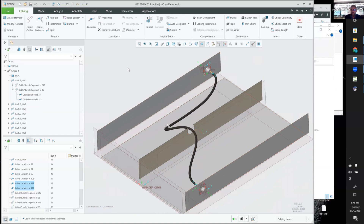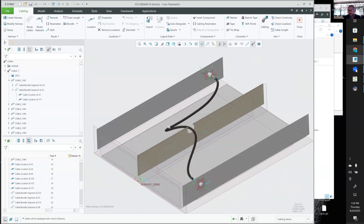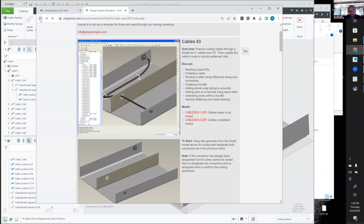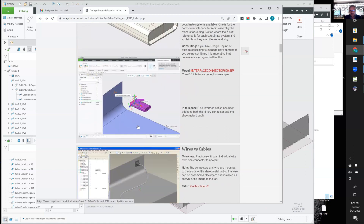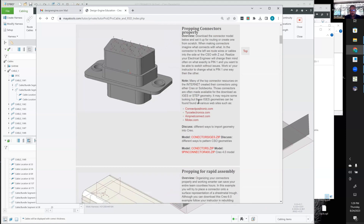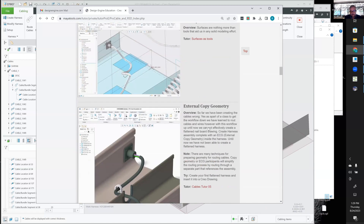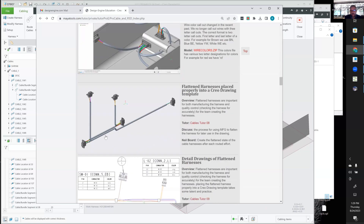Now I'm going to create a bundle that's going to connect all those heat shrink locations. This is the thickness of the heat shrink — let's make it a little thicker. You can assign color to the heat shrink so it automatically generates color — I've got BLK, but maybe GRY. I say 'along path,' go from one to the other, select them all, middle click, then go to thick wire — now you've got your wires all tied up. In the class, we build these by hand so we can get out of the way what top-down design functionality we want, and understand how those offsets work.